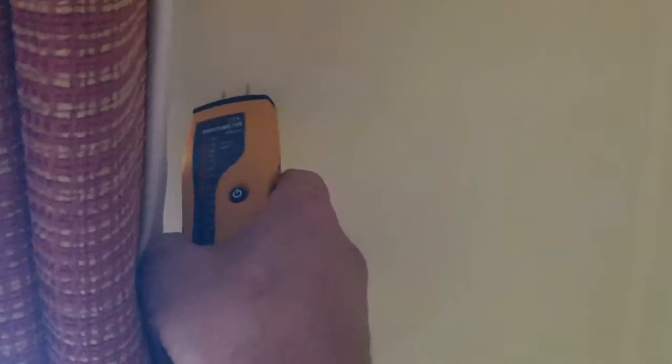And if you remember, it stops on that line there, and that line comes around, and that is that line there. And you can see there is a crack here. I don't know if it's possible to see it, but there's a fine hairline crack, and that crack goes up there slightly higher and across the wall. And that crack corresponds with the replastering that's been done, and this is damp proofing plaster that's been put on, and it is causing salt contamination.